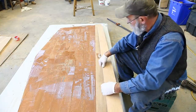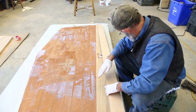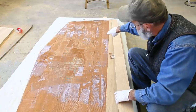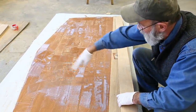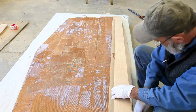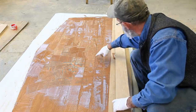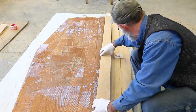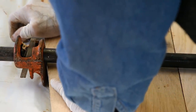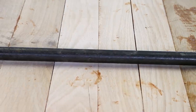We're just about halfway through gluing these laminates up to build this transom. Each laminate is laid a little bit biased to the other laminate, so they're not all straight across — that gives a little bit of diagonal support, but we didn't want to make it like plywood with the layers going 90 degrees to the first layer. So basically one layer is laid on the angle of the top of the transom, then the next layer is laid on the other angle. You can see the planking line going this way, and this layer is laid bias to that. We're going to clamp each layer as we go — we cut the layers exactly the same size so the clamp won't foul on the layer beneath it.